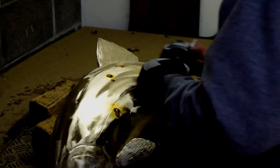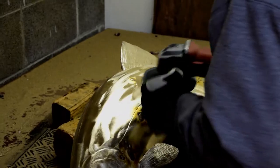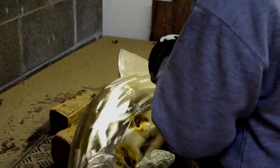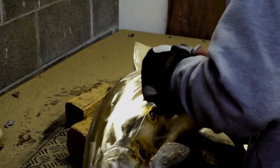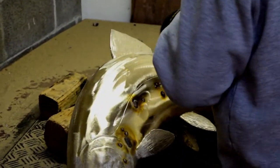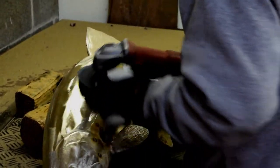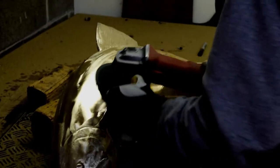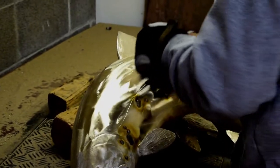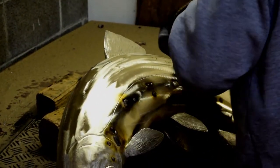If it is a large piece and it is cast in sections, they are welded back together, or the windows that were cut into the original wax that allow the slurry to flow inside to create hollow bronze are welded back on. Casting in sections allows us to create a very large bronze. There is really no limit to how large a bronze sculpture can be. Casting in sections and welding can produce an enormous piece of art.